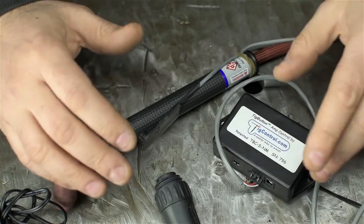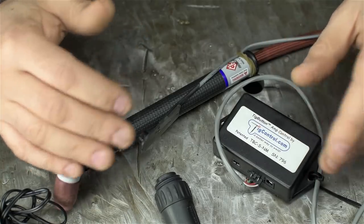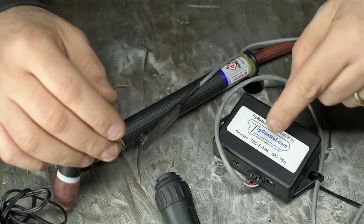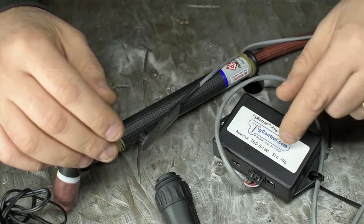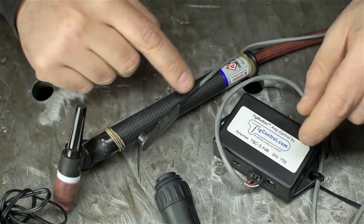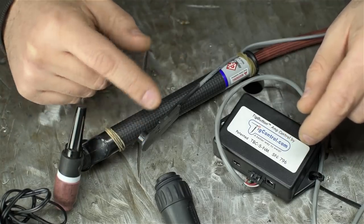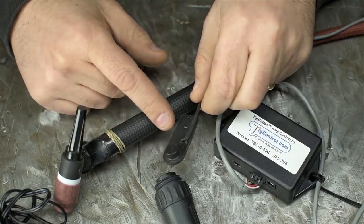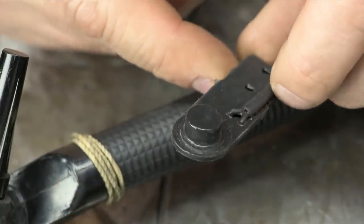The way this thing is integrated into your system, into the welder and the leads, really takes all this delicate stuff off of the battlefield. The brain box is attached to the welder. There's plenty of wire there for strain relief, and the button itself runs up inside of your torch cover and again can be strain relieved inside. The button is really the only thing that's exposed, and it's got one of those Plasti Dip coatings on it.